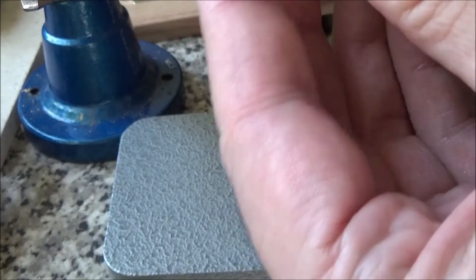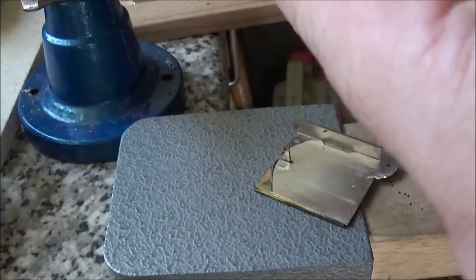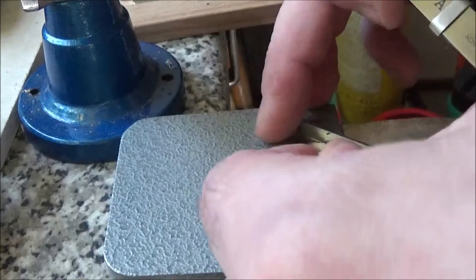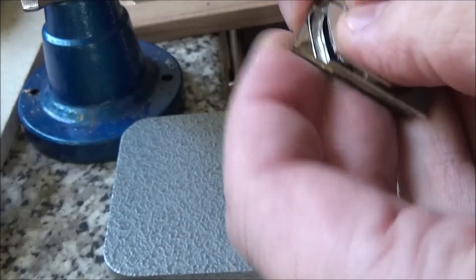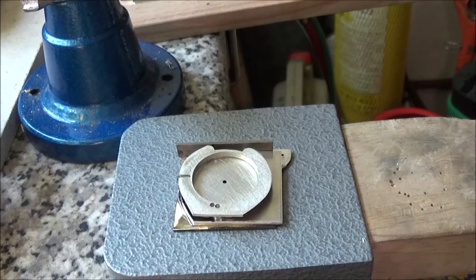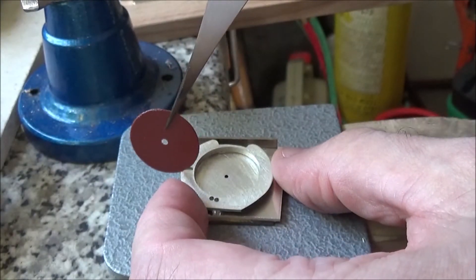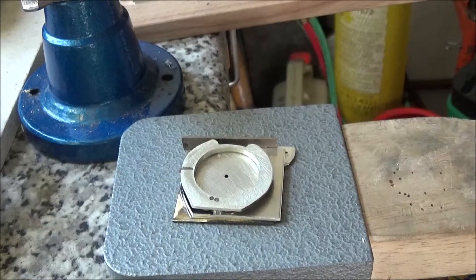I wonder if that's sitting flat enough at the moment. Doesn't seem to be as I would like it. Maybe I need to just take a little bit off the end of those claws so that that sits nicely. It's not quite sliding in there yet — it really clipped in firmly there. But I've got some little sanding discs that fit onto the end of my dentist drill, so I'll be able to just spread them out, make them nice, round them off a little bit, so that they'll actually clip home with ease.